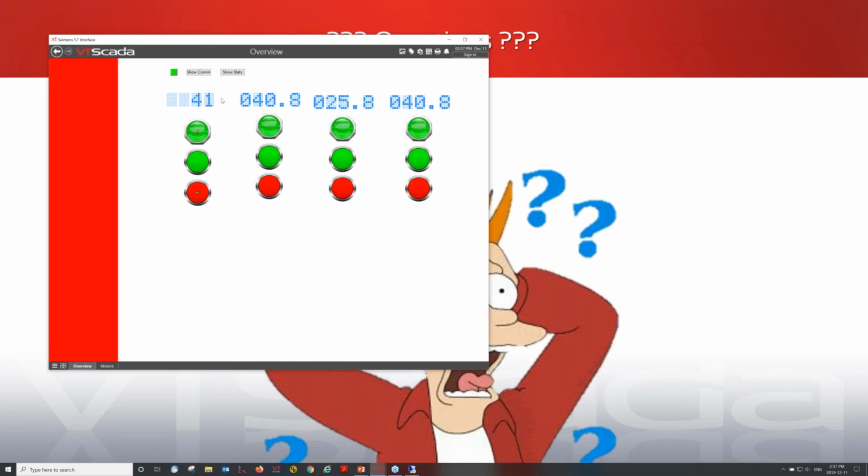Okay, very quickly then. All the tag types you see me deal with here, we've got digital status tags and we've got analog status tags. And version 11 had somewhere in the order of 10 different tags that were used for various I/O tasks: analog in, analog out, digital in, digital out, analog status, digital status, analog control, digital control, the pump tag, and there was one other, I can't remember off the top of my head what it was. So what we've done in version 12 is reduced the variety of tags. We've come down to a single tag that does the functions of all of those, all rolled into a single I/O tag.